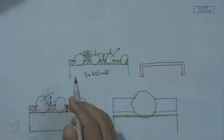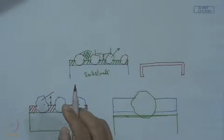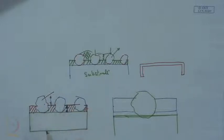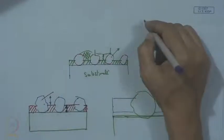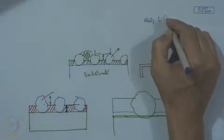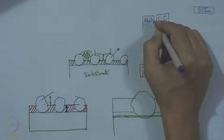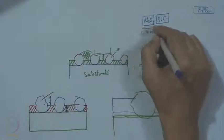The rate of wear will determine the service life of the grit. We know that aluminum oxide or silicon carbide are not as wear-resistant in comparison to CBN or diamond. Where we normally use silicon carbide as conventional abrasive, if it has to be replaced by super abrasive, the choice is diamond.